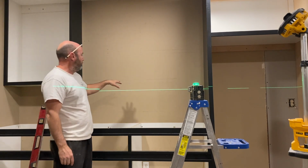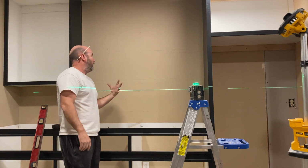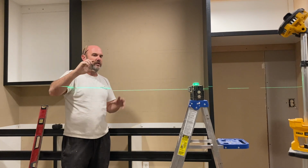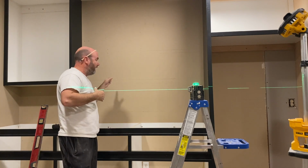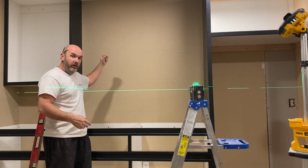And the way we do that is we get a little more invasive. No French cleats, no anything, nothing like the store-bought floating shelves. We're going to actually cut the sheetrock out. The shelves I'm going to do are going to be about 2.5 inches thick. You can make them thinner if you want to, with thinner plywood. I'll use a 1.5 inch piece of plywood, run it by every stud, and glue and screw it to the stud level, sticking out. You can hang from them.